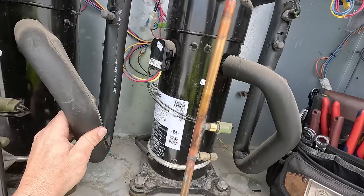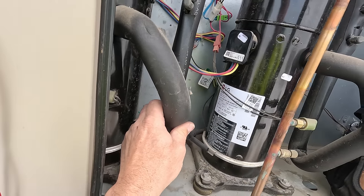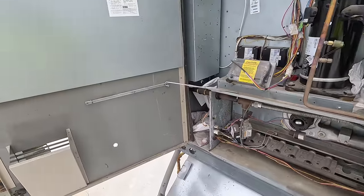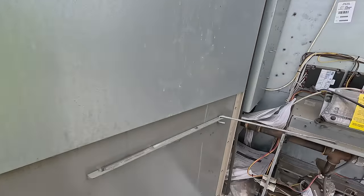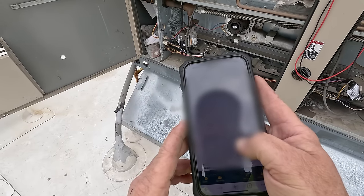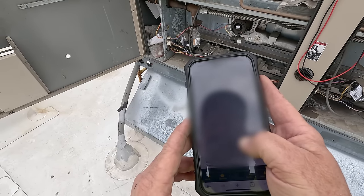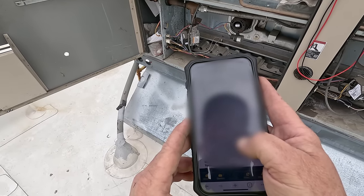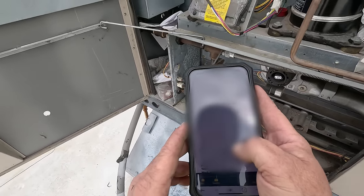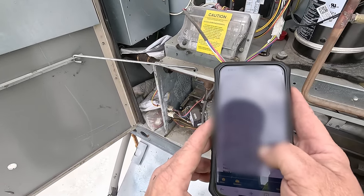Okay, this one, supposedly it's R22, it's not that. The compressor's not shorted. I'm starting to wonder, am I even on the right one? No, I have to be on the right one. We've got repairs needed as follows. K1 and K2 have contactors that are bad and will need replaced. D3 unit, semicolon, found stage 1 compressor shorted. So I'm assuming D3 is actually the one.